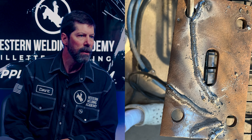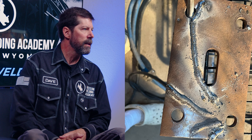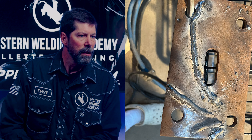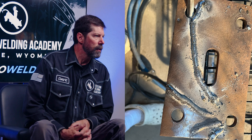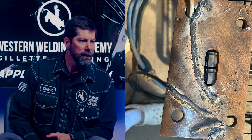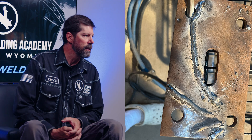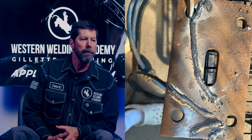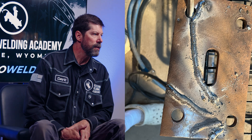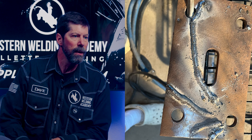For our last weld of the day, we're going to take a look at Vinny. Vinny is 13 and he's giving us some stick welding. He says he's doing 7018, 5/32, and asks: what would a good beginner heat be so I don't stick a lot? If you're sticking a lot, it might have a little bit to do with your arc length. But look at how tall that bead is — it doesn't look like it's really burning in so much. So maybe turn your heat up just a little bit. Give it five or ten more amps and see what it does for you. As I'm looking at this, I'm really seeing it lay on top, not really burning in. But then again, you might be used to working with thinner rods. So if you're running the same amperage on an eighth inch and now you've moved up to a 5/32, that might be why this is looking as tall and lumped up as it is.